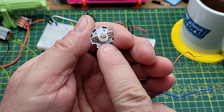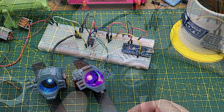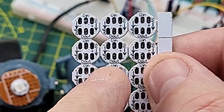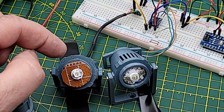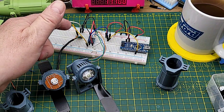Those star-shaped LEDs are not just available in white — they're also available in RGB. And why print one light when you can print a bunch of them? Here we have two different ones doing RGB under control of this Arduino Nano using two slightly different methods. This one on this side is just a standard NeoPixel, aka WS2812 LED, on a little circuit board. You can see the pins on the back — it's got 5V, ground, data in, and data out. You just snap these individual circuit boards off and solder them down to whatever you want, and in this case I've put it onto a little piece of perfboard and ran four wires out in some heat shrink sleeving onto some pin headers.